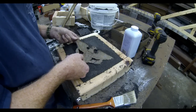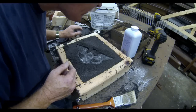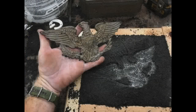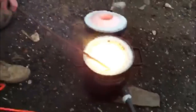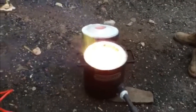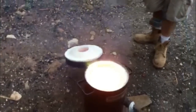This mold came out pretty good. Checking it over for the fine details, at this point I really thought we were on the way to a successful pour. We'd poured brass a couple of times before and never had a problem. This particular batch of brass — I can only blame the material — it didn't really melt. It turned into a powder and then into a sludge. We didn't have much additional brass in the shop. I added a few pieces I had and that seemed to turn it molten pretty quickly, but it just didn't seem right.